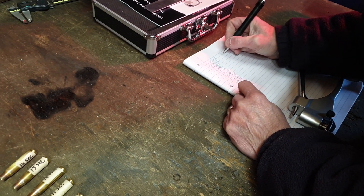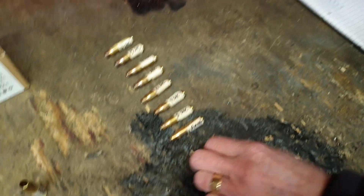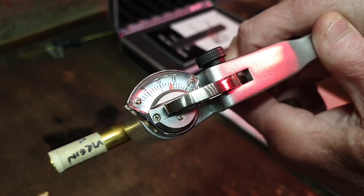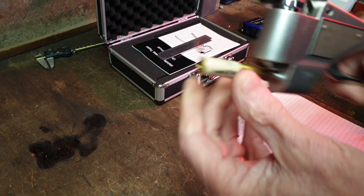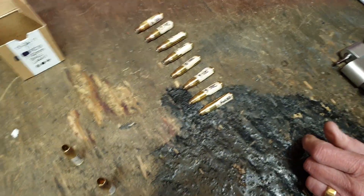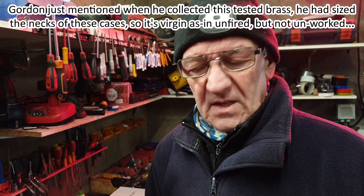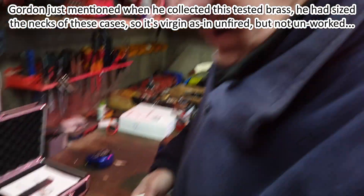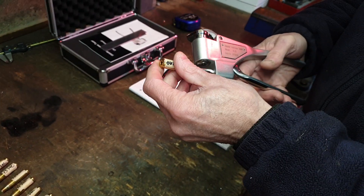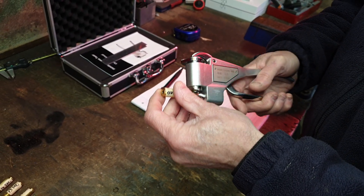This is Virgin B, a second virgin brass case — fourteen. And ninety degrees round — fourteen on the button, consistent. That's interesting, that's higher than my brand new Lapua virgin .22-250 and .243, which are usually 12 to 13 — slightly less hard. So the .308 is slightly harder. Okay, let's try the once-fired. Presuming this is once-fired but not annealed, so it'll be harder. Sixteen.